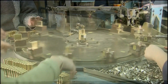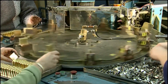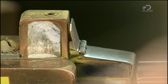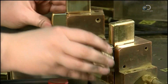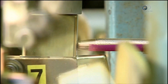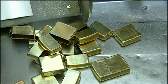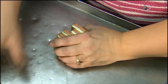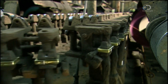They're collected and placed on a revolving table, then slid onto a hinge to link the top and bottom pieces. An electrode welds the hinge to the case, and then a mechanical arm knocks them down a chute to a worker who inspects the welding job. As the cases move on a conveyor system, they get a quick buff to prepare them for plating.